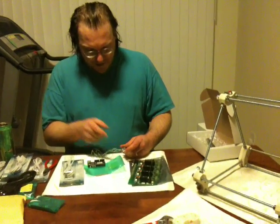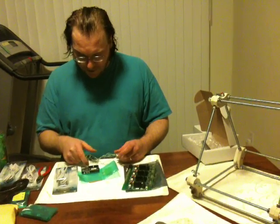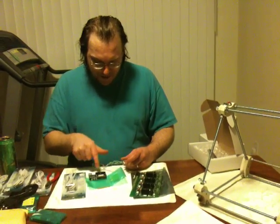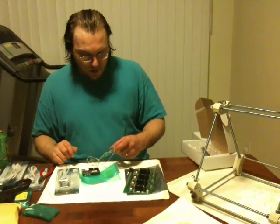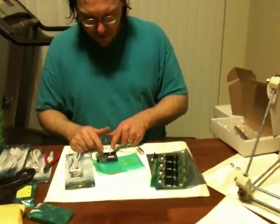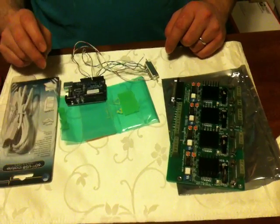Pins 2, 3, 4, 5, 6, 7, 8, 9, and pin 25 are used. Pin 25 is used because it's a ground connection and it goes to ground on the Arduino. 2 to 2, 3 to 3, 4 to 4, 5 to pin 5, 6 to pin 6, 7 to pin 7, 8 to pin 8, 9 to pin 9. That's how you wire up the parallel port wires to the Arduino, then you plug this into the board. And that is how this wires up.